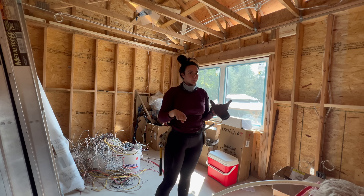So far I've only used 12 and a half bags with all this leftover and I have nine bags left — there's no way I need nine for just this. Before I move on, I wrote a panic to-do list at midnight last night, because that's when your brain starts stirring. I need to run this low-voltage trace wire to where it needs to go for the under-cabinet lighting. My plans say two inches off the wall, which is nearly impossible, but close enough to this stud — I'll drill a hole and it needs to be 36 plus 19 inches off the ground.